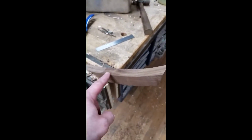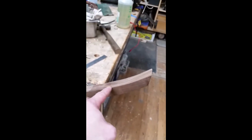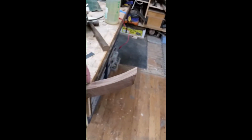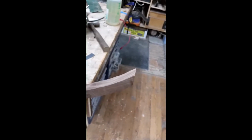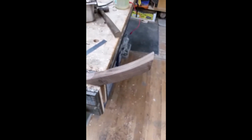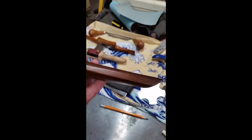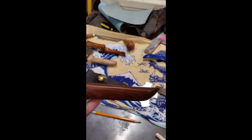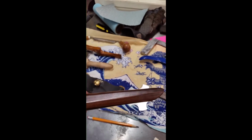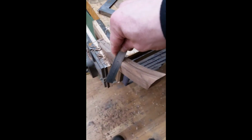All right, so we have this roughed out. Now, since I have a profile that's in pretty good shape, I can start coming in on the top here and putting in a more defined chamfer that goes along here. That's going to give me my thin top and some beveled sides that are thick, like we're used to seeing on the back of the blade. If I look at our example piece, you can see there's that top chamfer, which you'll see in various flavors as you look at different weapons from different makers and manufacturers. So we have our first bevel roughed in there.